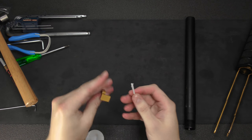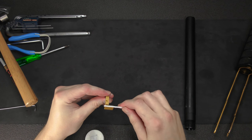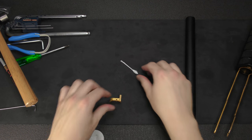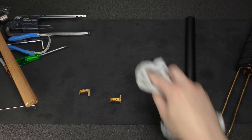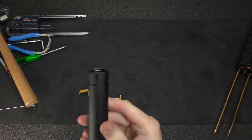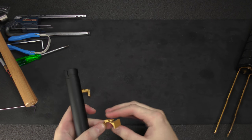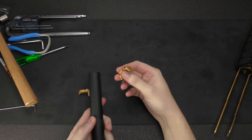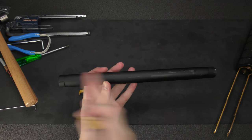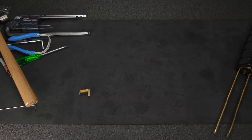I'm going to put a little bit of lubrication on these, and I want to put some right here where the forend arms are interfacing. Now I put the new part in this orientation - you want to make sure the countersunk screw holes are facing out, towards the barrel end, so the screws are seated towards the barrel.